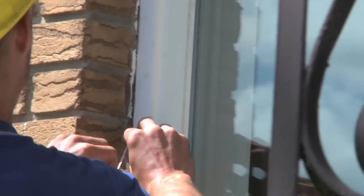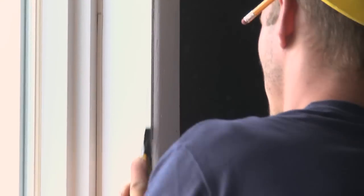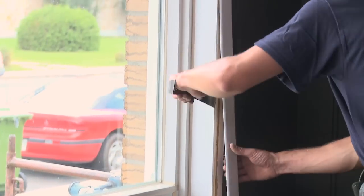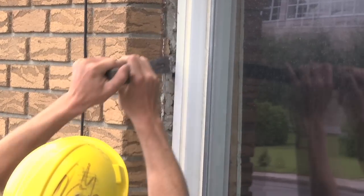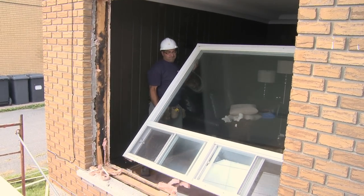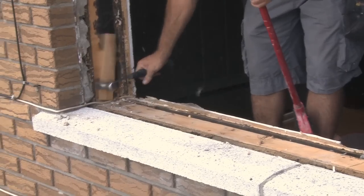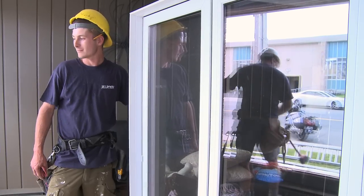A good installer should carefully remove the old window to avoid damaging the structure and any facing, moldings, etc. that will be reinstalled when they've completed the work. As a rule, we strongly recommend changing the frames of old windows. The space between the old frame and the wall is seldom completely air and watertight, which may increase heating costs. In addition, removing the old frame is the only way to detect hidden problems such as rot on the rough opening. We only keep old frames when the building is very old or especially difficult to touch up.